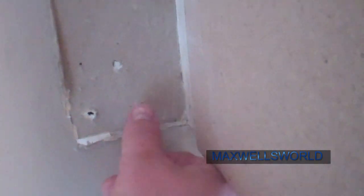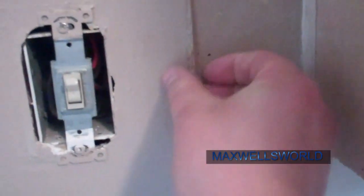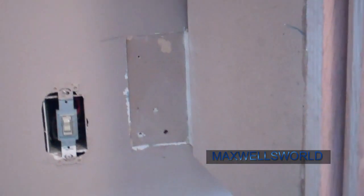And just like I expected, it pulled away the first layer of paper. And you look here, you can see we got a bit of an indent to deal with now. So what we'll do is clean this up, pulling away any of the glue ridges and a few things like that. Probably going to end up giving her a bit of a gentle sand, and then we'll end up filling it. Trying to fill this hole, maybe float the wall a little bit in the area. So guys, let's get at the top one, and then we'll start working on the little pine filler right here.